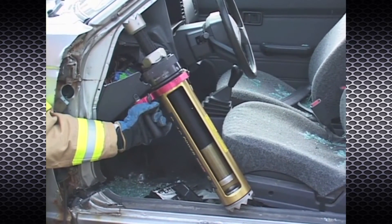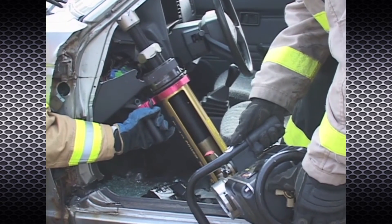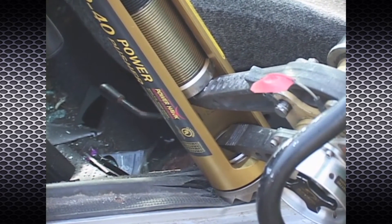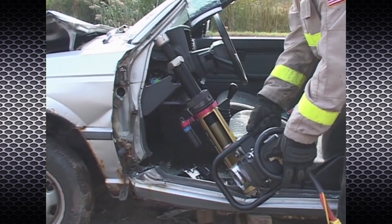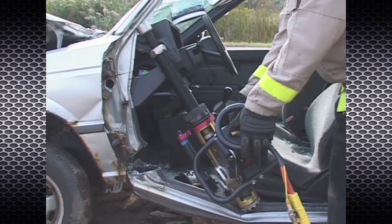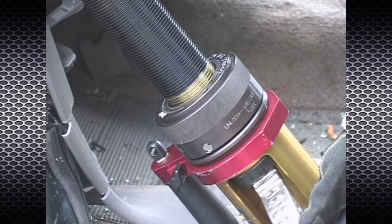Insert the spreader tool tips into the slot beneath the primary extender and slowly begin to open the spreader arms. If necessary, apply slight downward pressure at the RAM base to help initiate the purchase point. As the Power Pusher is extending, make sure that both head and foot adapters are safely engaging the working material. Operate the spreader to the desired extension of the Power Pusher. Maximum extension of the primary extender will be indicated when the gold color and its threads pass through the top of the Zipnut.